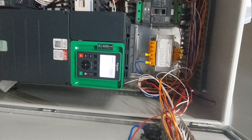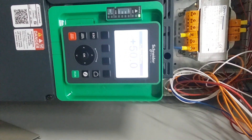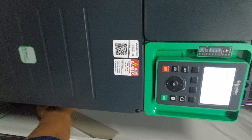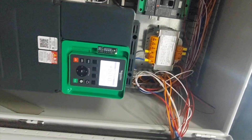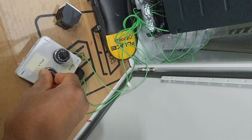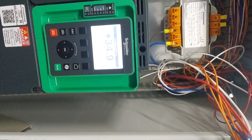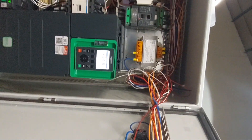That's the 37 kilowatts variable frequency drive. I put a potentiometer here to regulate the speed. If I put it at half speed it's never going to trigger the output, because it's currently on 34.9 hertz — not full speed. So I'll start it now.